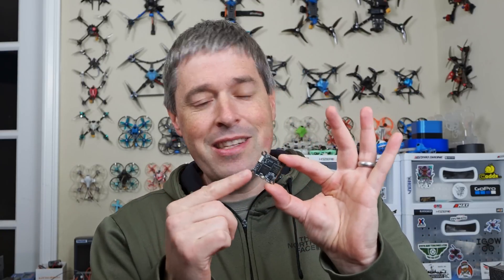I'm not going to talk about the VRX too much today — leave questions in the comments below. But there's other stuff I want to show you, including this guy right here. This is the final version of the 1S video transmitter for HD Zero, and I'm really excited about this because it's going to make it possible to build lighter and smaller builds with digital FPV, making digital accessible to more of our tiny little builds, which digital hasn't really been practical for in the past. The real blocker has been having a one-cell voltage.